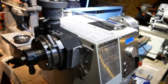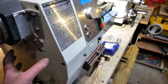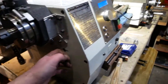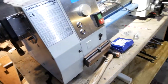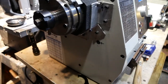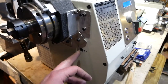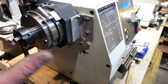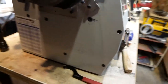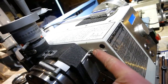This little bracket is just angle aluminum — nothing special. Underneath the door I've added a piece of 10-millimeter thick 6061 aluminum plate. The entire side cabinet was originally bolted to the spindle casting by six M6 screws. I reused those exact same holes, made standoffs to meet up to the inside of the aluminum so everything locks together. Now there are four M6 screws pulling the door in — though the standoffs are exactly the right length to make the door close perfectly without needing to pull it.